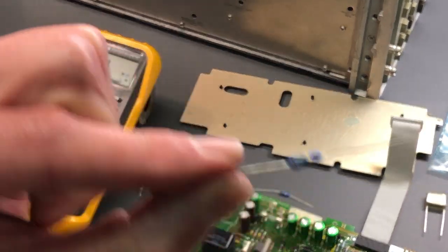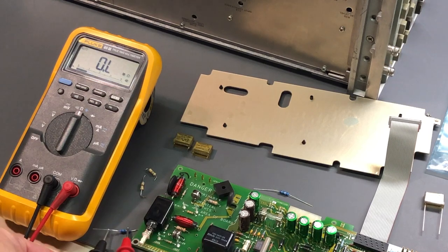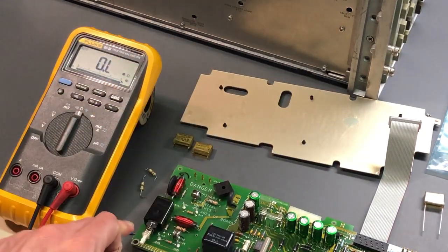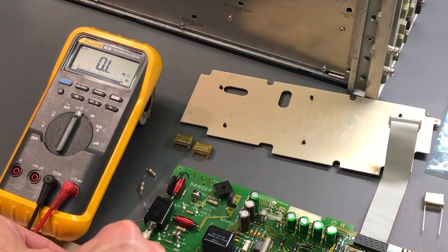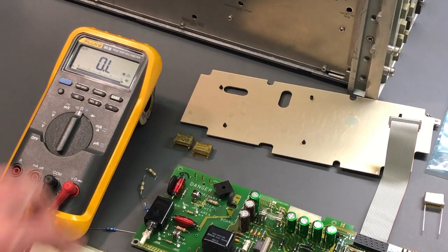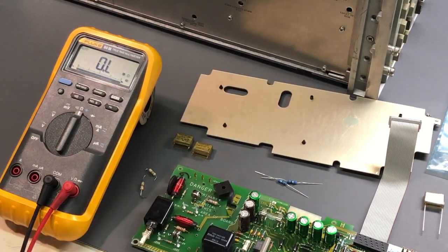My replacement resistors are right here. Let's measure them - the first one is 15.2 ohms, and this other second one is also 15.2 ohms. So those will be installed and that'll be in good condition over there. Let me get the camera repositioned and we'll take a look at these RIFA capacitors on the capacitor analyzer, and we'll see exactly how they measure when they're beginning to age and those cracks appear - and compare them to a brand new one. Be back in just a moment.